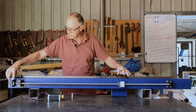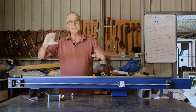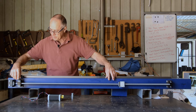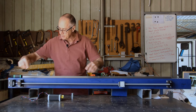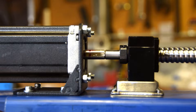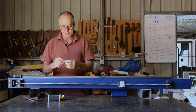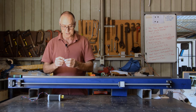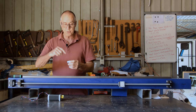My reference point was the bracket and the stepper motor on the end. With the ball screw next to it they didn't line up — there was about a 14 mm gap between the motor shaft and where the ball screw alignment was. So I needed to make some 14 mm spacer blocks. Once I positioned them I was able to get the two shafts to line up perfectly and join them together using these little couplers. It's a vibration damper as well, with grooves machined in it and a clamp screw on either side. For added security I added a 5 mm grub screw because the motor has a flat on it, so the grub screw lines up with the flat.